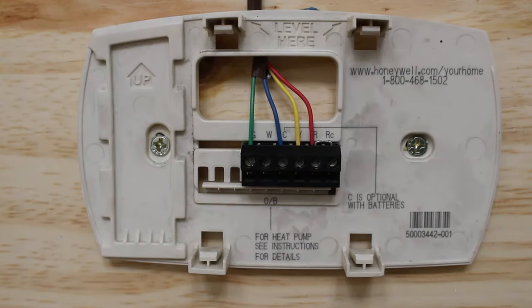That's why I love magnetic jumpers. You're not gonna stand there with a piece of wire or like two screwdrivers or a jumper cable for who knows how long. Up to 5 minutes is a typical delay. So after a predetermined amount of time passes by, that's when everything's gonna start. So if you look closely into the circuit, right there is a timer for the cooling circuit. Boom. You see? Now we have our cooling.